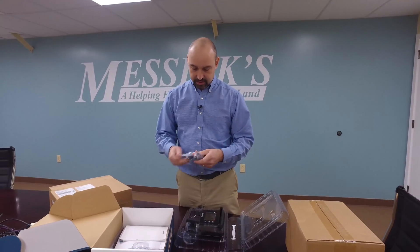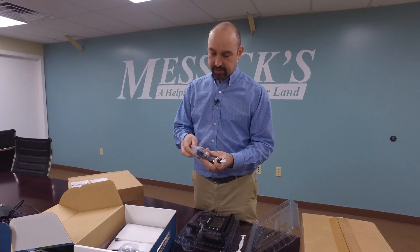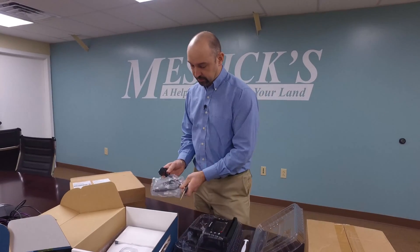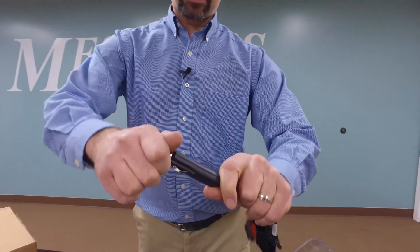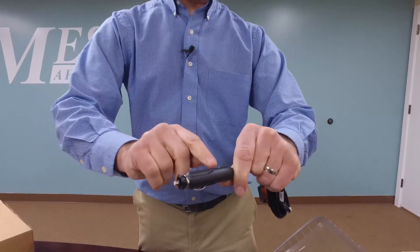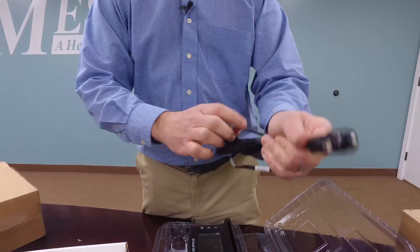The next thing in the box is the power cord. The EZGuide 250 uses 12 volts and they use a cigarette-type accessory plug to get power into the display. On this side you have the 12-volt plug, and something to point out is that the tip does unscrew and there's a fuse in there. If you ever have trouble where the light isn't coming on when you plug it into a known good power source, check your fuse in there — it's the first place to start.